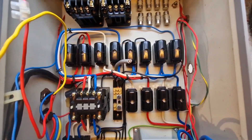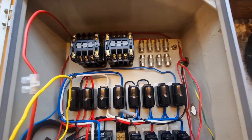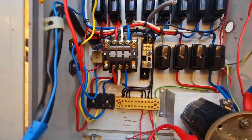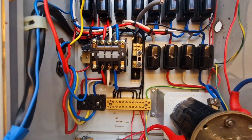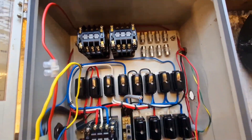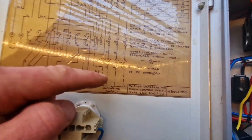At the top there we've got the usual selection of spare cartridge fuses, although on this one we do have two spare main siren contactors. We can see the one that's wired in service there, and if that had had a fault they could have easily changed it over on site without having to bring one along. Following the wiring diagram, we can see the main incoming power coming to the isolator.